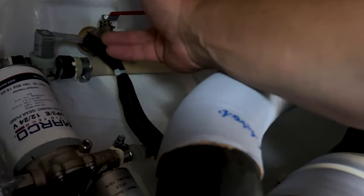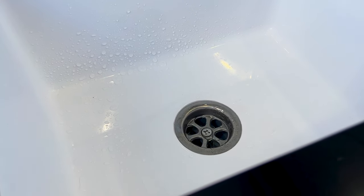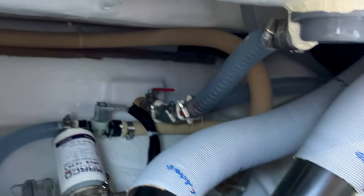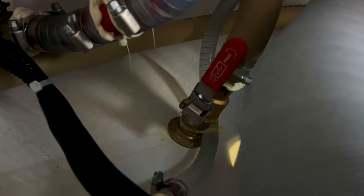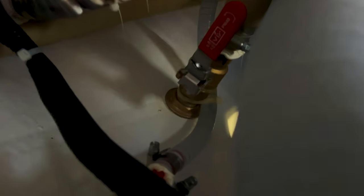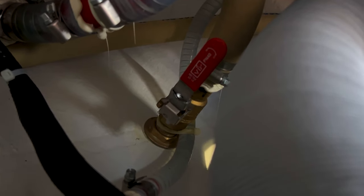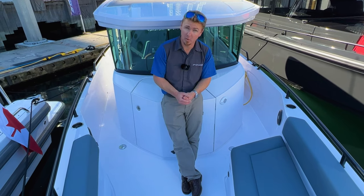There's a through-hull valve for the sink here — it's in the open position, directly connected to the sink. If your sink is backing up and just won't drain, check that valve because it might simply be shut. There's also Webasto ducting in here, and over there is a discharge valve for the waste tank. There's a macerator pump discharging right there. That valve must always be open before you use your macerator pump — if it's shut you will cause damage to your system. Always check that it's open before overboard discharge.